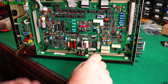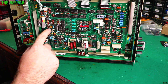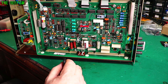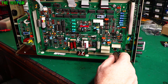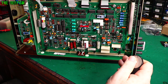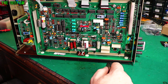Unsurprising - every Datron I've worked on so far, all of these caps have been bad. So I'm going to pull this board out and replace all those caps. I've had a quick look around for tantalums which look burnt or discoloured or anything like that. I can't see any bad tantalums. This one here is looking very slightly off - you can see on camera it looks slightly darker. Maybe that's a clue to what's going on, or maybe it's just shadows. Mostly it uses tantalums. Tantalums are alright as long as you don't expose them to much ripple - they will last for ages. If they have a high ripple current, then yeah, they're not going to like it. That's the critical thing for power supplies. If your power supplies go bad, you can actually blow the tantalums out. A tantalum failure is usually a symptom of a fault, not the cause of a fault. Usually anyway. Let's replace these.